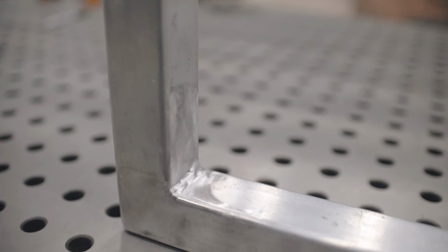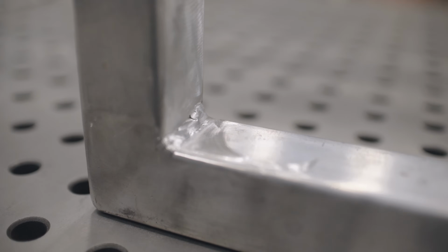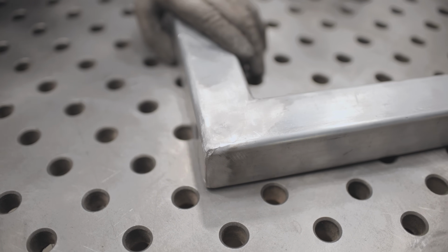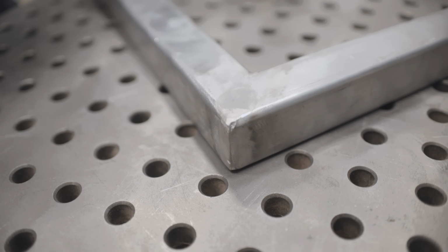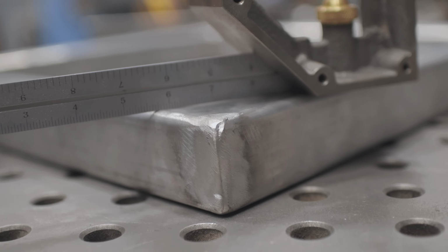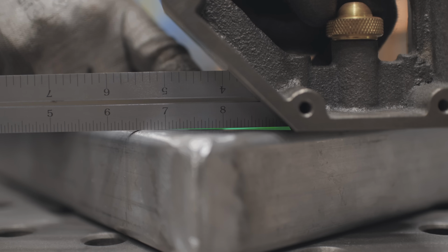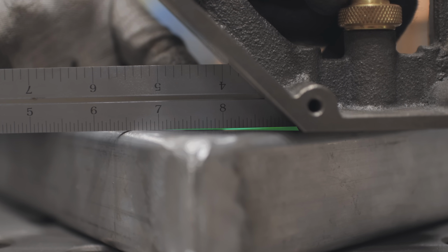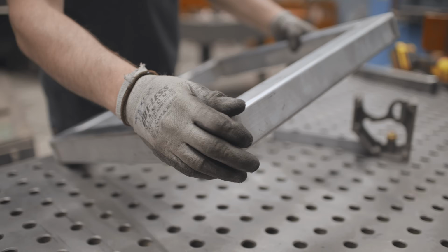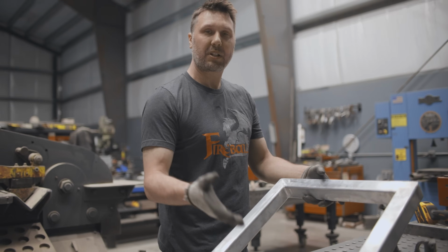Completely ground off the entire weld because your welds are ugly and you don't want anybody to see them. Or you're trying to have somewhat of a flat surface, kind of designed for production work, something where you don't really want the weld there, but you're not gonna take a lot of time. You can tell whoever ground this, they actually ground too far and you can see low spots. You can see some light shine through there, and you can tell it's sloppy. None of the corners line up. This isn't very precise grinding. That's a stage 2, and for most applications this is completely acceptable.